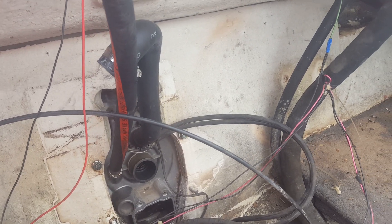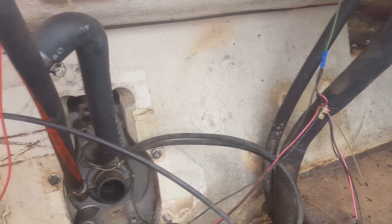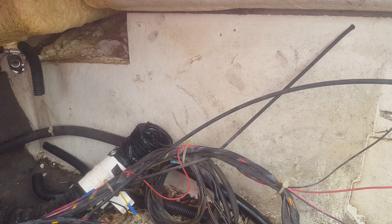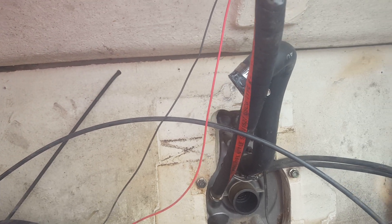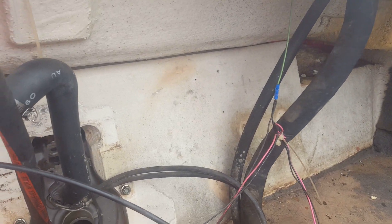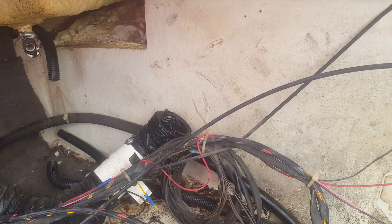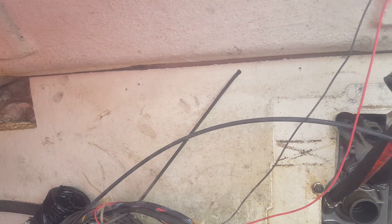Okay, part 10 of the video series. I've cleaned up a lot of these old random screws. I don't recommend putting a lot of screws in your transom because it's just another place for moisture to get into. If you do, I prefer that they get sealed with some sort of sealant around the threads. I probably pulled out about 20 screws — they were still stainless, but not sure if it caused any of the rotting.